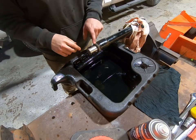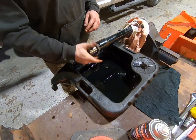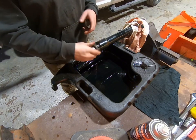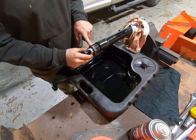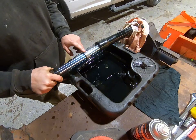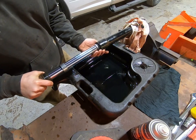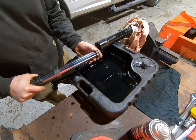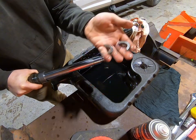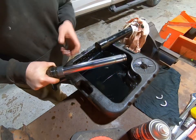Now we've got the cylinder here on the bench with our gland nut already broke free. There are three parts inside: you have your gland nut with all your seals, a bearing or spacer, and then on the end you have a split ring bearing. Make sure you don't lose any of these parts. The split ring sits in this groove here — put that aside on a nice clean rag so it doesn't get too dirty.